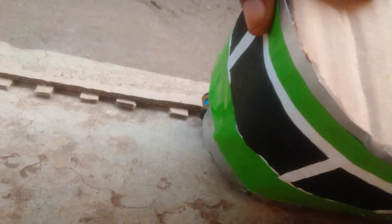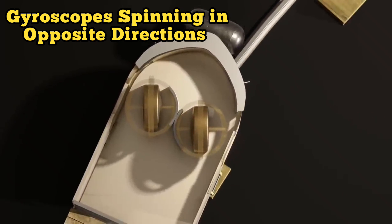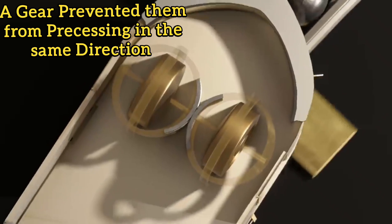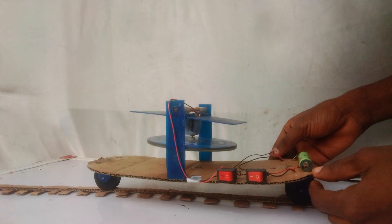Overall, the train was a success. Although it had problems bending into curves, this was because I used only a single gyroscope. In Brennan's design, he used two gyroscopes spinning in opposite directions, and a gear was placed between them to prevent them from going in the same direction as they tried to maintain their rotation, forcing the two gyros to rotate with the whole train. But I hope to build a better one soon.